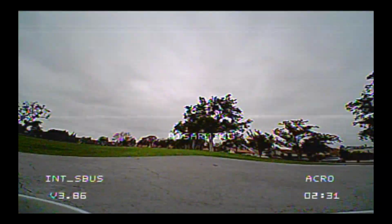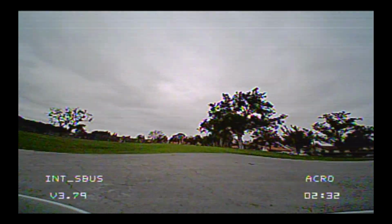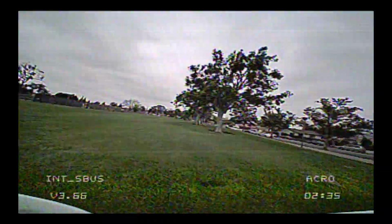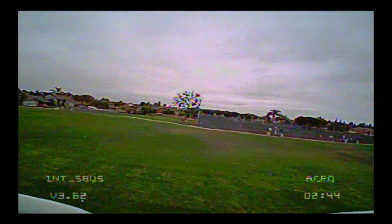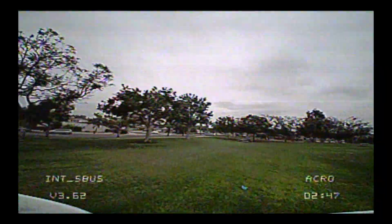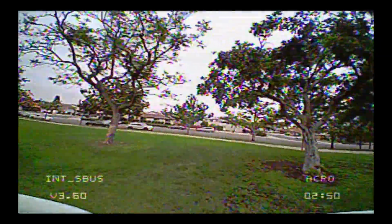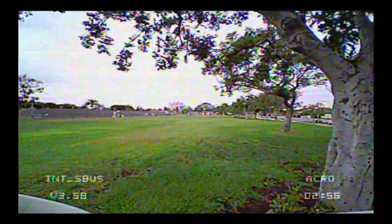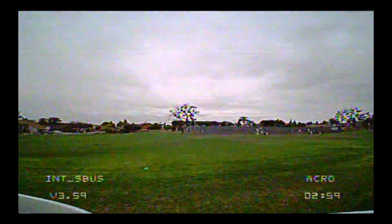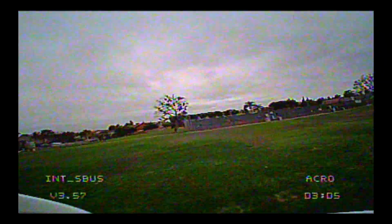Oh, goodness. I think I had a failsafe there. All right, not sure what that was. Seems to be okay. Let me just see how far away I can get with this here. I mean, it has a D8 receiver in it. Oh, the video gets really bad over there. Okay, that's why. It's because of where the VTX antenna is. It's pointing straight out the back. So when you're going this way, it's pointing away from you, but if you go sideways like this, then you can get better video.